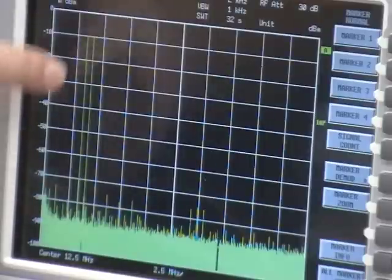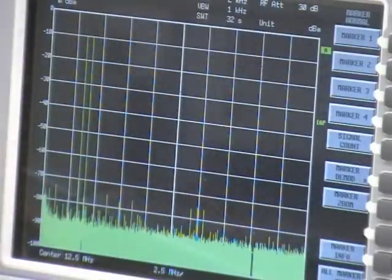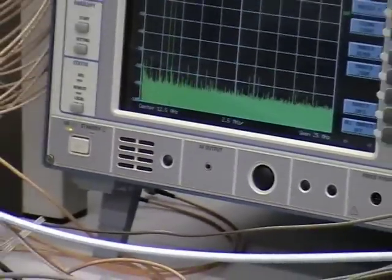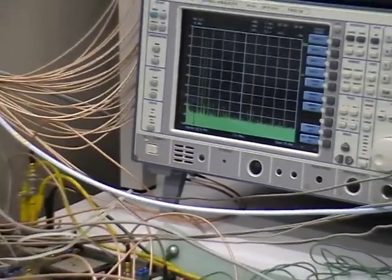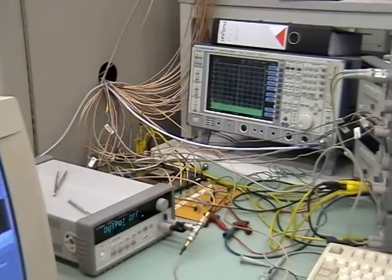The generated harmonic distortion is due to the mismatch of the DAC signal current sources. In addition, the harmonic distortion components intermodulate between each other and considerably limit the useful dynamic range of the DAC.